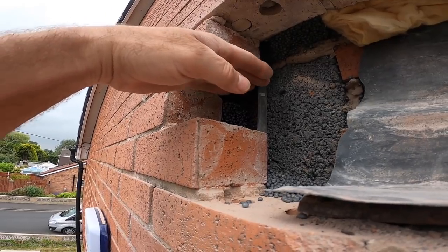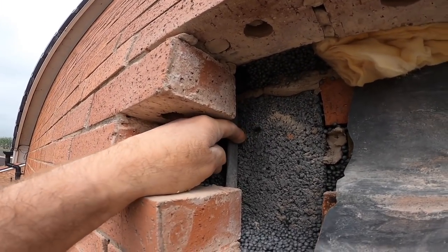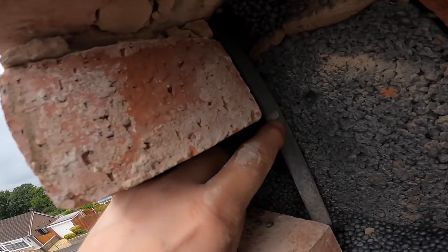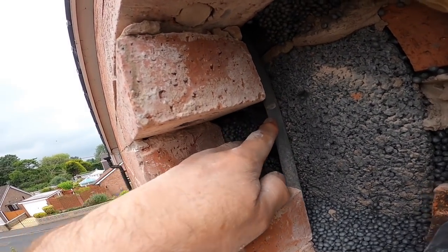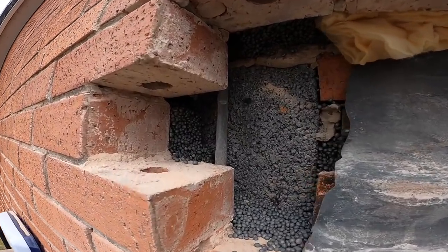I use a 200mm bit, so I'll go right in. You can see where I hit the internal block. And whizzing away, and then look at that. It's just grazed the top half a millimetre of the cable. That's a 10mm cable as well. That was a close one. Just shows you don't know what's in there.